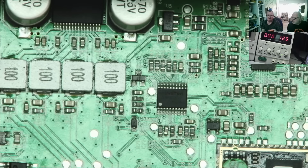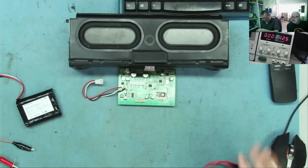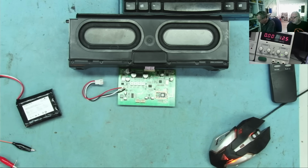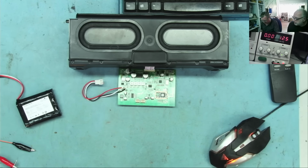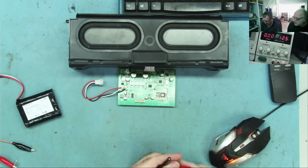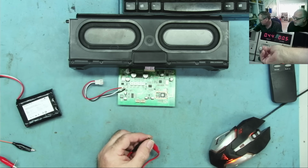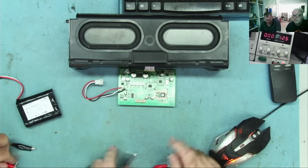And then we set the current for something we want to charge the battery with. Let people see what we're doing then. 3,000 something milliamps. So give it 500 mil. You want me to set the current limit? Yeah. What do you want me to set it to? 500 mil. Half an amp? Half an amp, please. Okay, so we just short these together to do that. Yes, this works. Fine. Is that close enough? This is close enough. Okay, well, hang on. So, an amp?